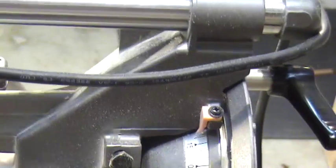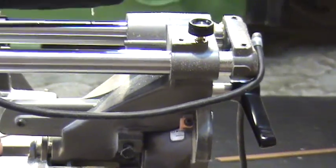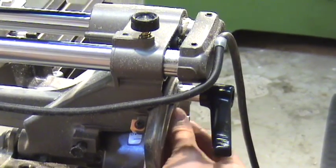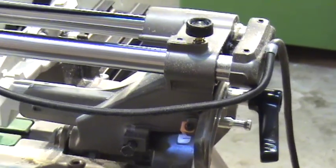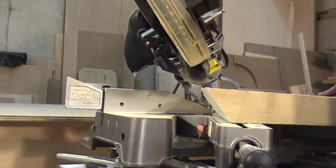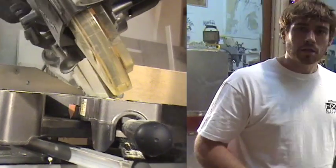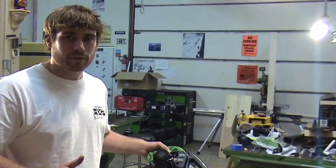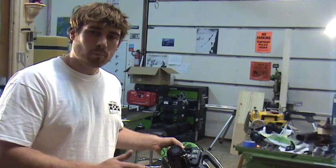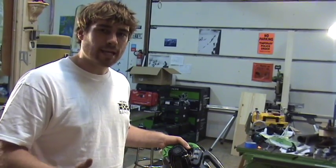Similarly, loosen the handle and come back, and the saw stops at 90. In order to go past 45, or to tilt 5 degrees to the right, simply pull the pin located directly under the lever. Now the saw can tilt 5 degrees to the right and up to 50 degrees to the left. This is useful because, in older houses or when making specific cuts, you can't always guarantee a perfect 45 degrees. This tool allows 5 degrees in either direction to accommodate any variance you may have.